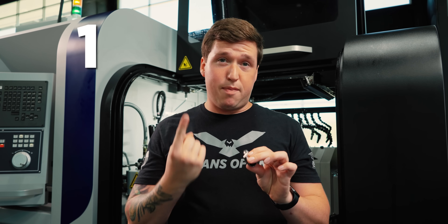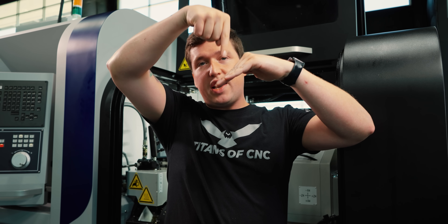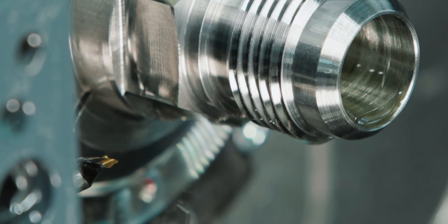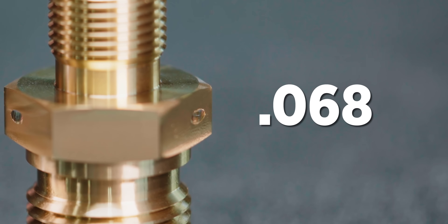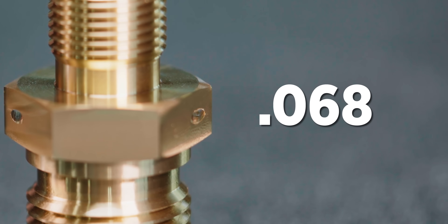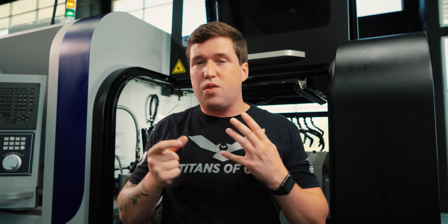This is bad for two reasons. Reason number one: you're drilling into the side of an angle with an end mill. Eventually that tool is gonna get dull, it's gonna push away, and it's gonna break. Then your drill's gonna follow it and break. And then who knows how many parts you're gonna run before you realize this. Reason number two: these holes aren't always standard sizes. You'll see a wire hole that's like 68 thousandths — that's a metric size. A 1/16th end mill is only 62 thousandths. So if you have a 68 thousandths wire hole, you have to come in and stab with a smaller end mill, then mill a circle, then come in with your drill and follow it. This is a lot of work and it really isn't worth it.